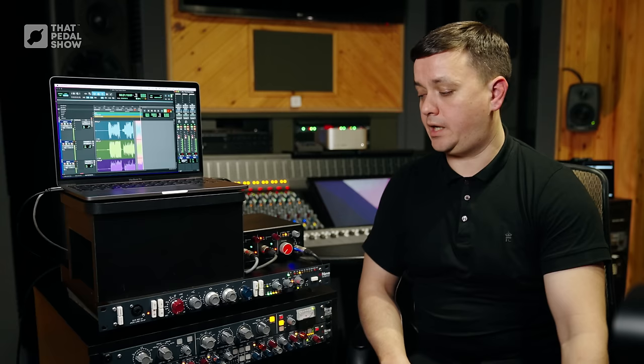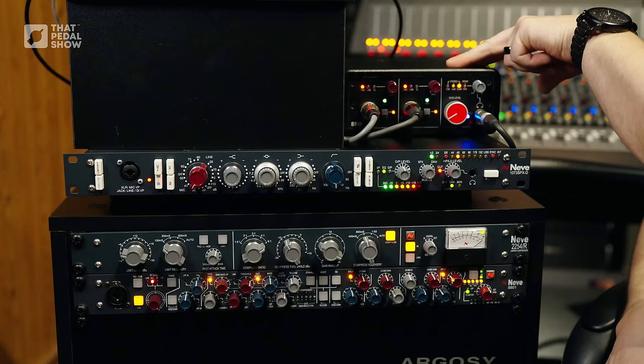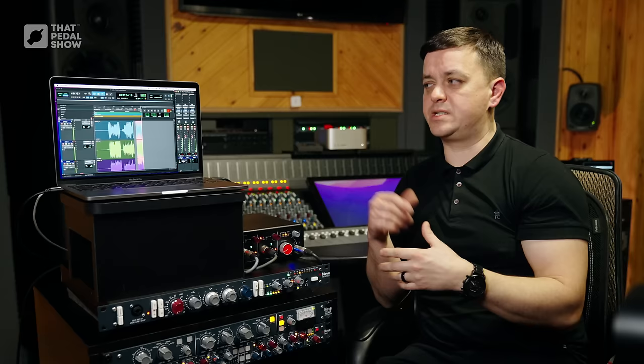Yeah, exactly. So with the room mics, we have the Blumlein pair that's set up in there, and they're going directly into the 88M preamps. Now, these are slightly different to the 1073. The 1073, as we mentioned, has that transformer in, EQ, and then transformer output stage. The 88M is technology that comes directly from the 88R console, the big one you see at Abbey Road and Capitol, but it's a much more modern console.